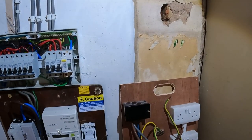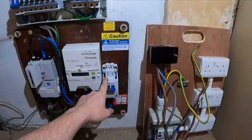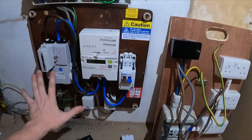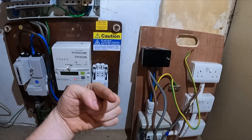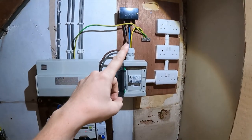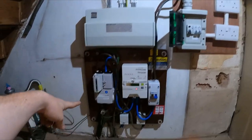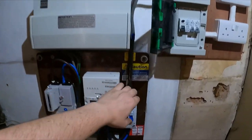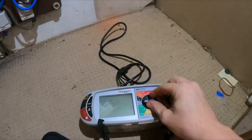We don't want any live wire coming out here because nothing will trip if a live cable gets pulled out — the only person hurt will be whoever pulled it over. Now I've got the board on, I've linked the earth across into the board because it's already pre-earthed and my earth lead won't reach across. Board's on, screwed back — now let's get a ZS reading.